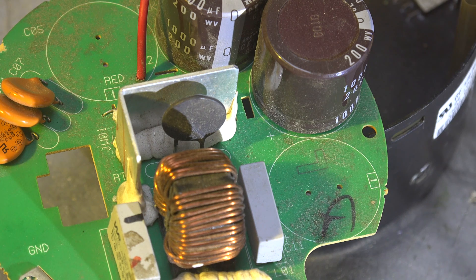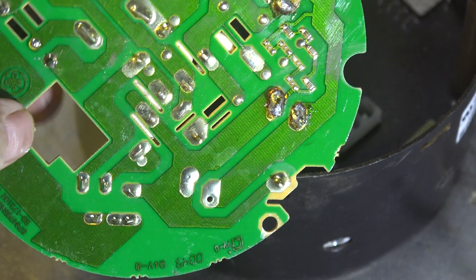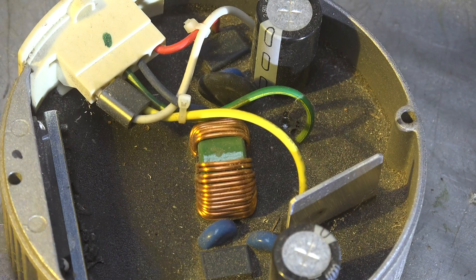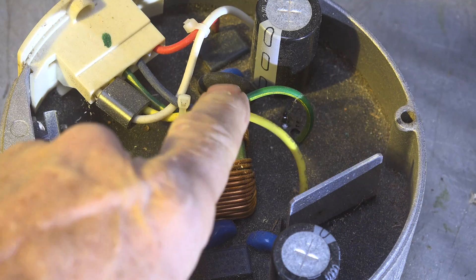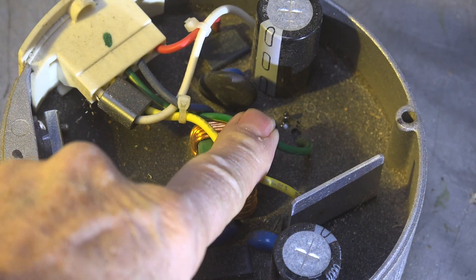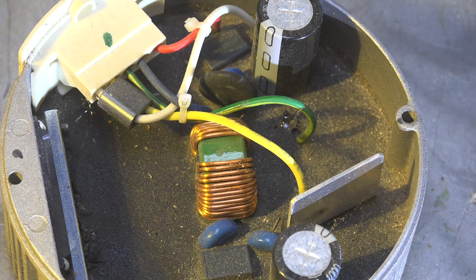Of course you gotta pay shipping and so on, but it is a pretty simple repair. I have had some that if you look at the backside, the traces were burned - you may need some repairs there. Now this one's epoxy. You can fix these even if they're epoxy, because that thing is right there - kind of hard to see - but it is right there and of course it can be removed and the wires tied together.